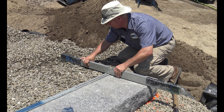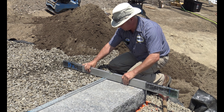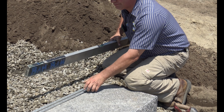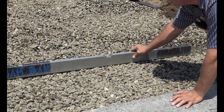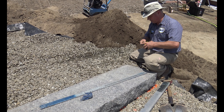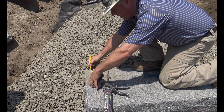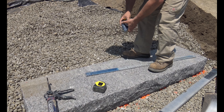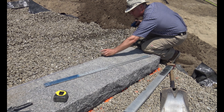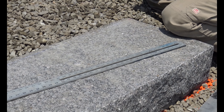I'm making a big step tread here, so you don't have to get super accurate — just a little bit of adjustment. I'm going to pitch the stairs forward just a little bit. Once that's level, I double check across here and it's dead level, perfect. For a nice deep step tread, I come back an inch so I have an inch overhang. I mark that at one inch on both sides, grab my chalk line, hold it right on that red line nice and tight, give it a soft snap — a nice crisp line, my one-inch offset.